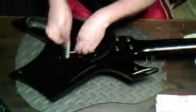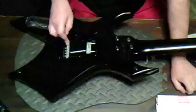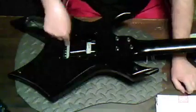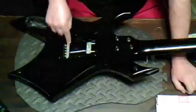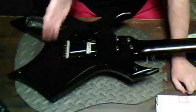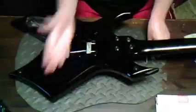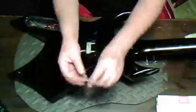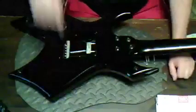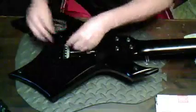Or I had the block backwards. Like I say, these blocks really don't have a backwards per se, but it depends on how at the factory they drill these spring retaining holes. Again, sometimes they do them straight, and sometimes they'll do them with a slight curve because the spring has a curve to them. I've seen plenty of ones that were drilled perfectly straight. So, at any rate, it seems to be working now.